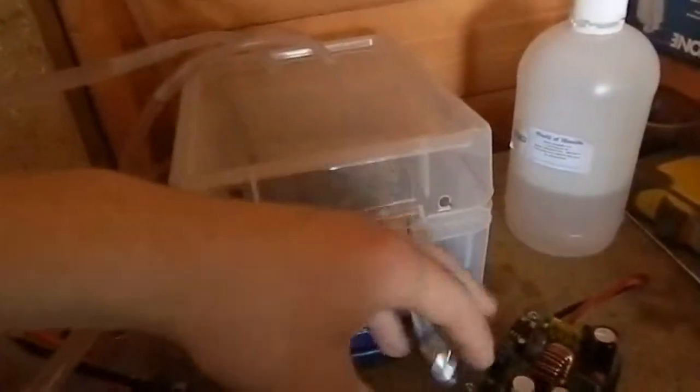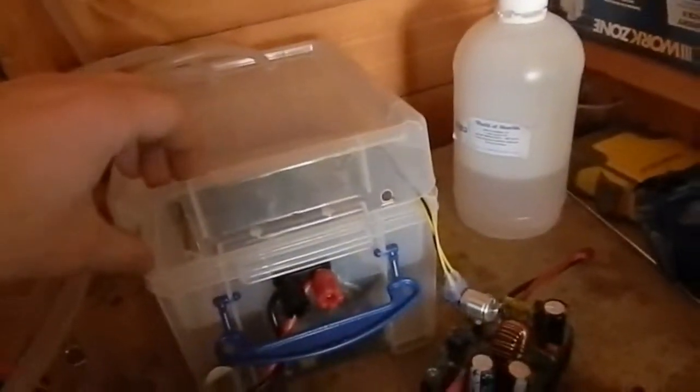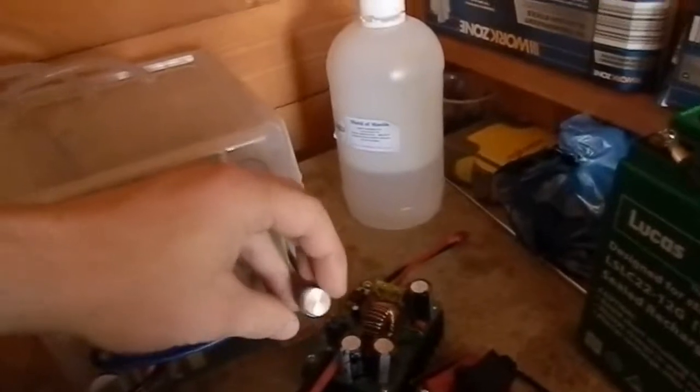But on 12 volts, the maximum this inverter will really give out is about 200 watts. Well, rather, at about 14 volts. But at 24 it'll happily run at 500 watts continuously. Even at night when I've got it connected to the batteries, it runs no problem, and I might show that later on.